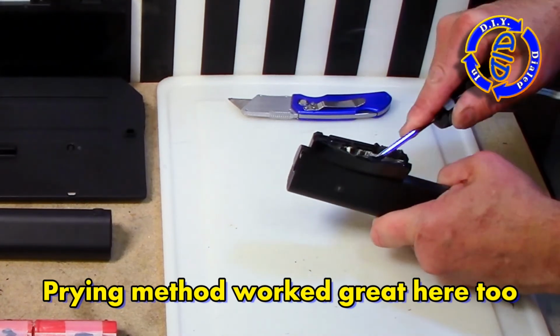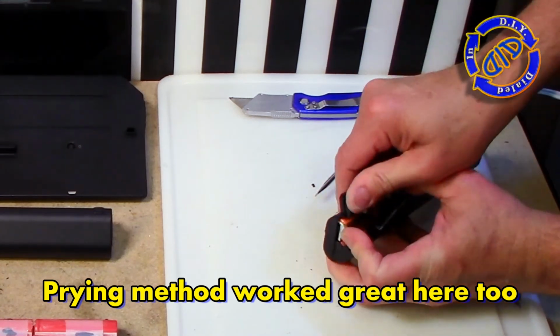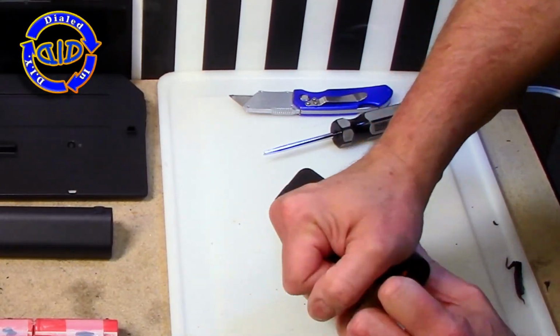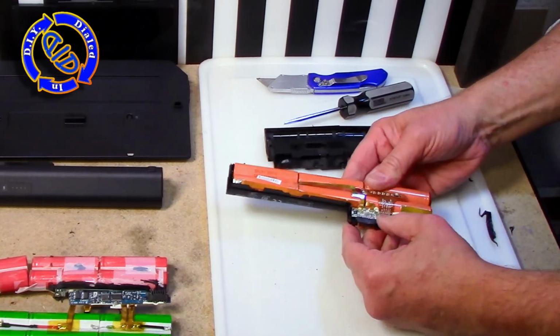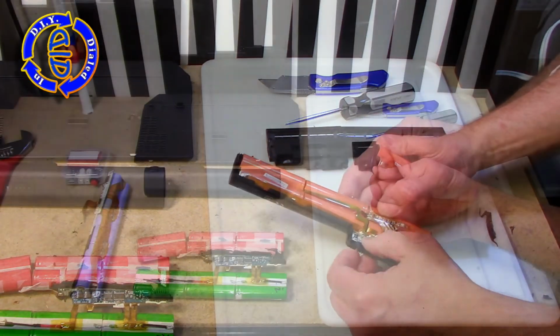Here's a little fun fact. If you're newer to working with these batteries, you might be wondering why I've been calling them 18650s. It's a rather straightforward name because they are typically about 18 millimeters in diameter and 65 millimeters long. The last number, the 0, is actually because it's a round battery. And there you have it.